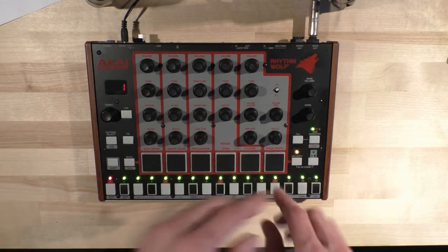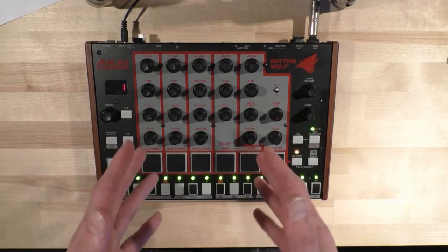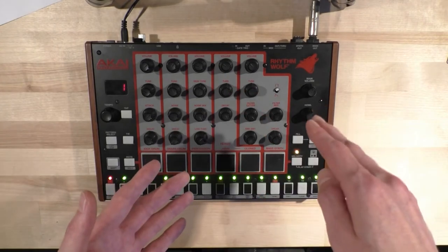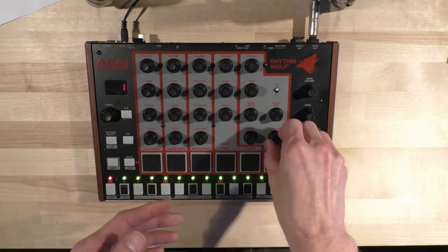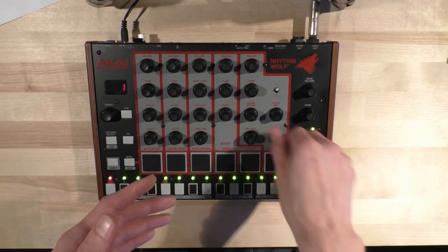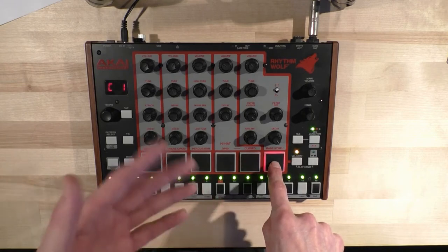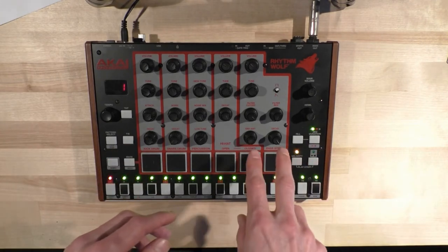It also decays out naturally, so you actually hear the full tail. I didn't adjust the VCO much because I was concerned about having to reprogram it to get it to retune itself. So instead, I just got rid of the mute function. There was a circuit inside which shut off the VCO after the decay had reached a certain portion, which clipped it so you didn't get to hear the end of the notes. Now you can have very short or reasonably long decays, and it's a little bit longer with more accent. So there are still two separate envelopes.